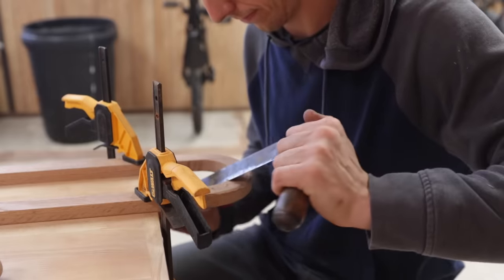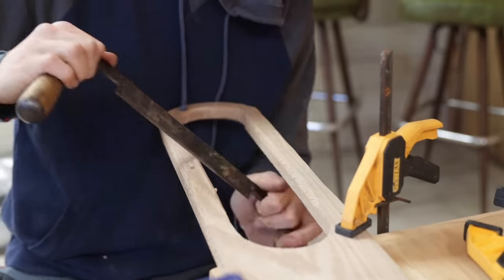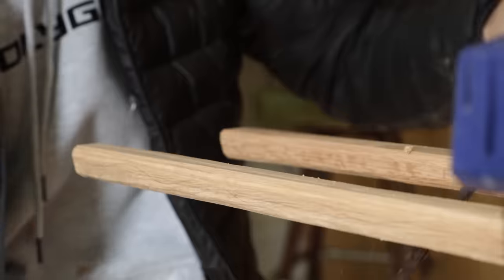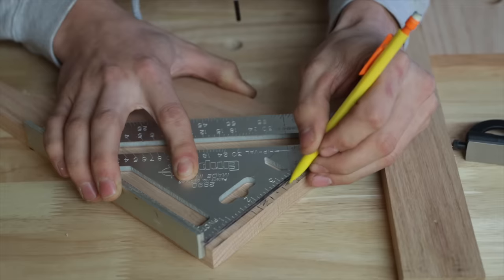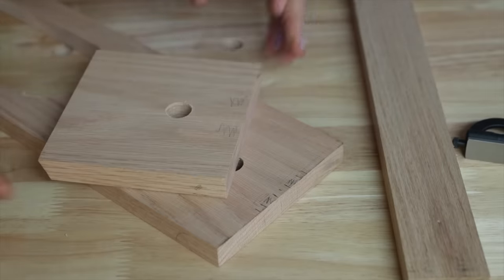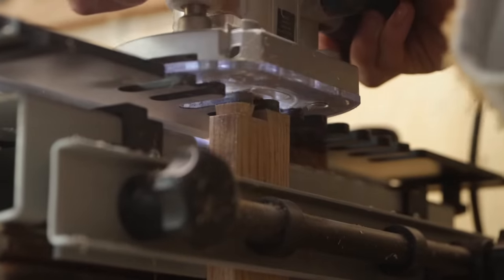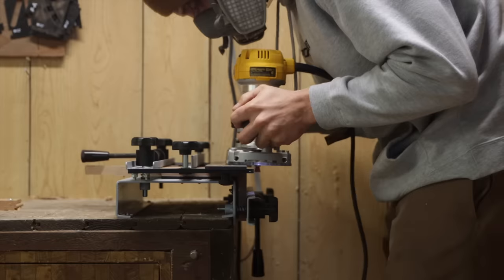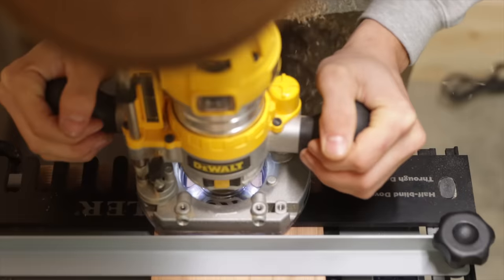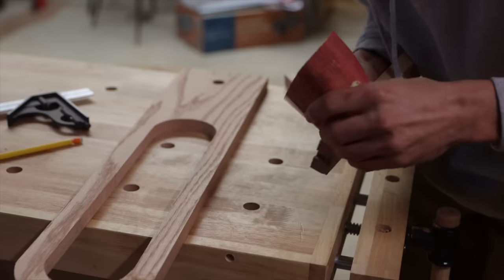I got out my draw knife and roughed up all the edges to give it a hand-carved look, which ended up making that rounded-off edge match most of the other parts. For those making dovetails, I made two half-blind dovetails on both sides of the back brace and two sockets on the back sides of the bottom and top boards. This was my first time using this dovetail jig and it turned out pretty awesome, and with a bit of cleaning up we can start pre-drilling holes so things can finally be put together.